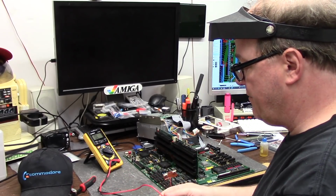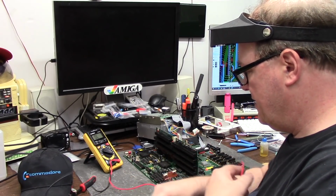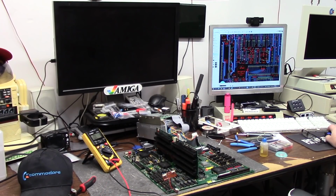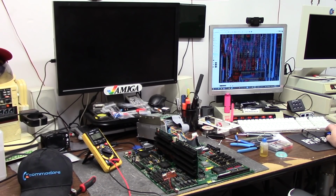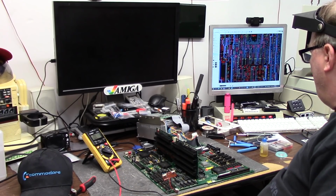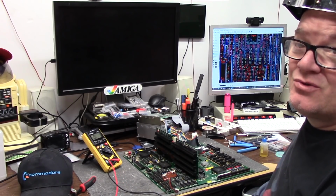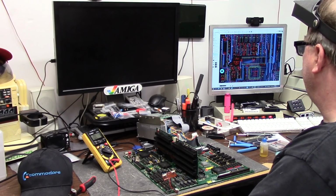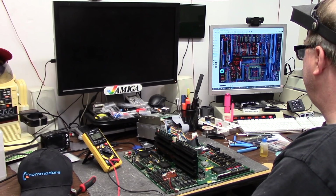Remember, this is 30-year-old lead solder on acid-damaged stuff. 481's been replaced, 477's been replaced, 480 pins out. It's still pointing to these bad RAM chips. Now, I could tone out these guys. These are the D42101C-3s, $27 a pop. The battery damage was still right around here, and all this has been replaced.